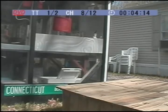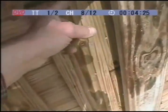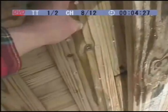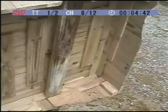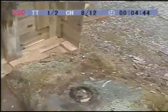That's not too bad — might fine-tune it a little bit. I'm going to try to jam this 2x6 in the middle of this to support it, because when you start standing on it, being that these boards are only held together by these pine strips, there's not going to be much strength. But if I put this in there and hammer some nails into it, I might be able to get some strength out of it — it's worth a try. We'll get that done and then drop this down on top of the stump and see how it is.